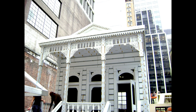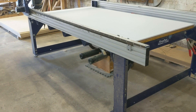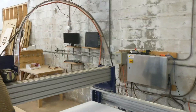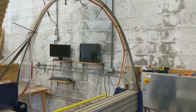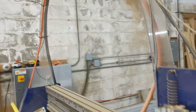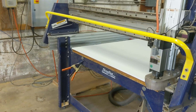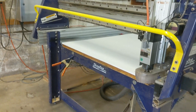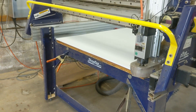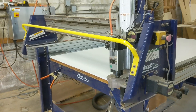As with everything else I have, it's not current. The current tools have three legs down each side instead of two, and they have E-chain instead of this arch. But this one works great for me. I'm used to it; I know exactly what it'll do. I cut at between 5 and 6 inches a second, jog at about 15, and it cuts great. I've had it for a long time — it's sort of the hammer that fits my hand.